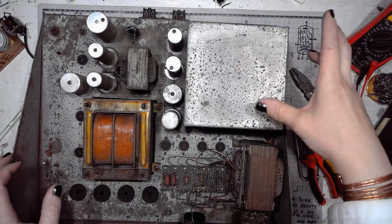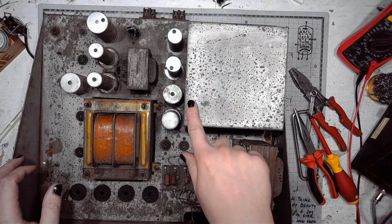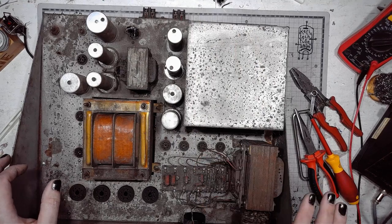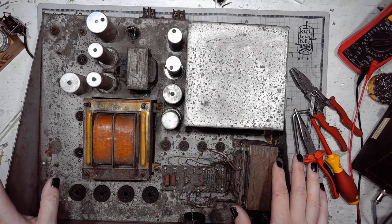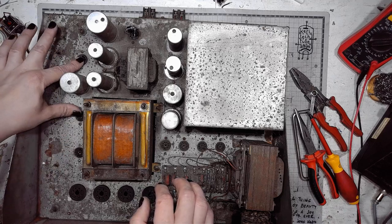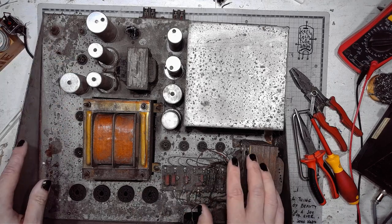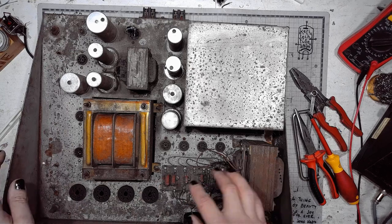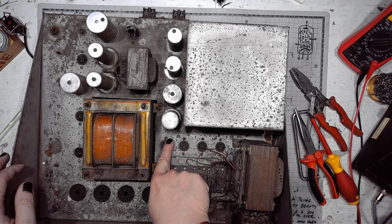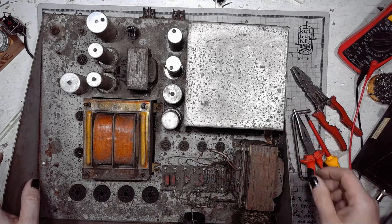Underneath this can we've got a mains transformer. The metal can provide some additional shielding against the electromagnetic fields. And there are three sockets for the ECC81 or 82 and 83 tubes, and of course EL34 sockets. Those sockets are for the EY88